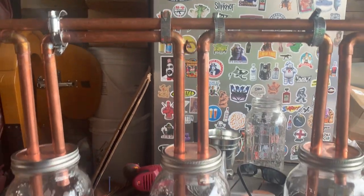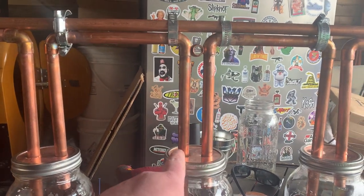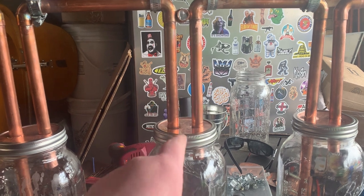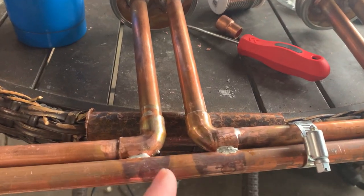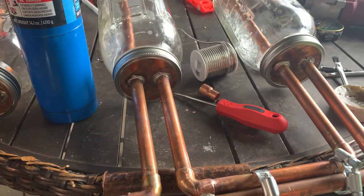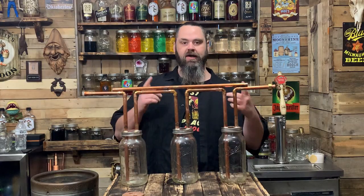You're going to want some hose clamps and a level to level your pipes. Start with one and then try to level it out. When you're soldering, you might want to get a wet rag and put it around the rim so you don't burn up your lids. Use hose clamps to clamp this pipe on and solder it to all these pipes as bracing. Get a pipe and run it from one end all the way to the other and solder it on. Sometimes you have to take two hose clamps and make one.